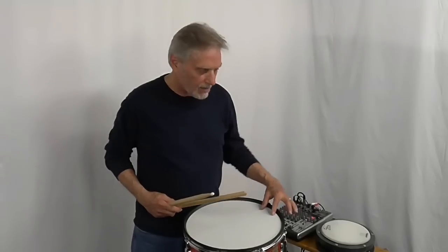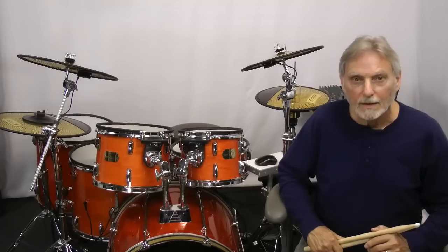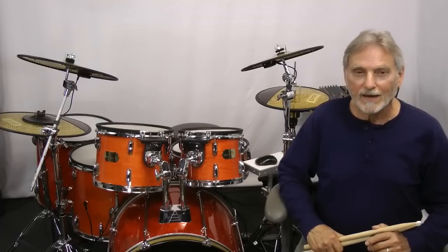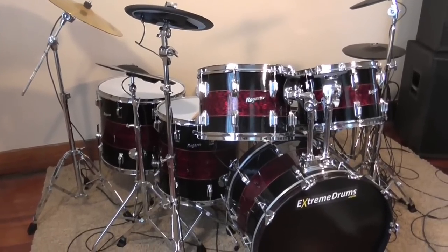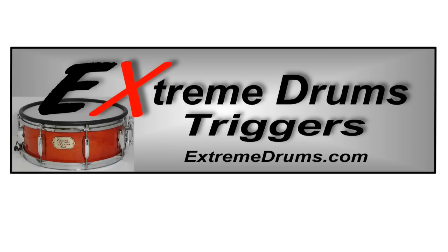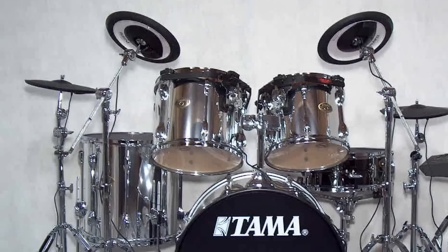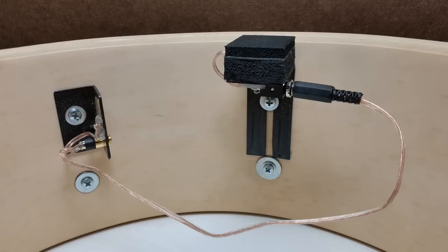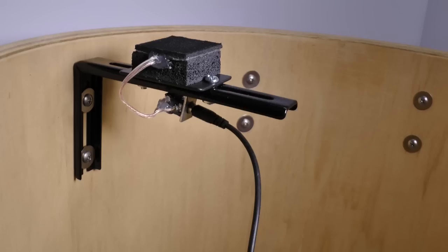Eventually I started building triggers that mount on the edge of the drum because I didn't like hitting right in the center with a center-mounted trigger like a lot of people are still doing today. If you're playing really delicately and you happen to hit right on the center of the trigger, it's going to sound like you hit hard — and that's not always the best scenario. So I build triggers that mount close to the edge; that way you're not hitting the trigger, and you're getting the full dynamics of what you're really playing. In 1998 I took my Rogers drum set, a set custom made in 1970, and converted it into a full-size electronic drum set, and that forever changed my drumming experience. Then in 2003 I put together the website extremedrums.com and started selling converted drum sets with my custom-built internal triggers to drummers across the United States. Later I redesigned my triggers so drummers could easily install them into their own drums, and now after several improvements through the years, Extreme Drums triggers are more sensitive and responsive than ever before.